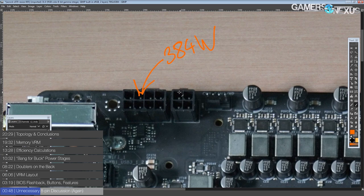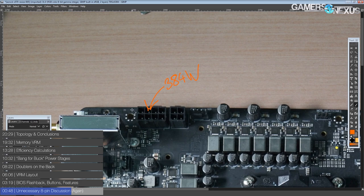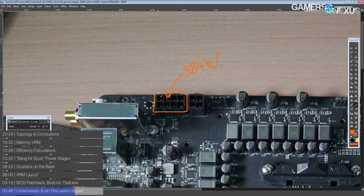The fact that this board has an 8-pin plus a 4-pin does not make it in any way inferior to motherboards that have two 8-pins, because you're never gonna need the second 8-pin. Maybe on liquid nitrogen it might be beneficial to plug in an extra 4-pin, but for daily usage, boards with a single 8-pin, or 8-pin and a 4-pin, or 8-pin and another 8-pin — it doesn't matter. One 8-pin is more than enough, especially if your power supply comes with actual 16-gauge cabling. The high-current version of the connector can handle well in excess of 500 watts — 13 amps per pin pair. For daily usage, this is just not a concern.